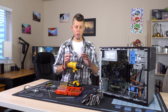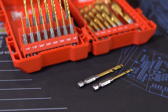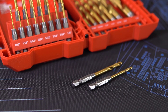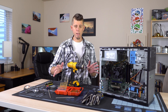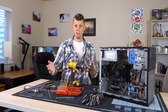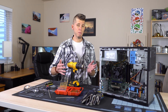Since you're going to be using a drill, obviously we need some drill bits. For the standard rivets we're going to use a 1/8-inch bit, and we're going to use a 3/16-inch for the larger stuff — those are the only two drill bits we need. These ones are specifically made to go through metal, so they'll chew through it real easy. But if you don't want to spend the money on metal-cutting bits, regular bits could do the job — they'll just take a little more time.